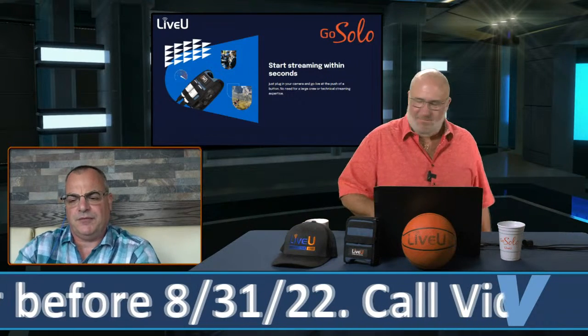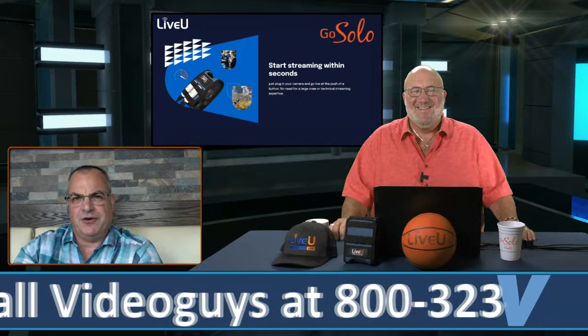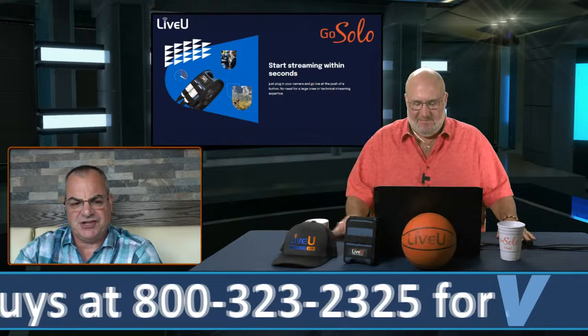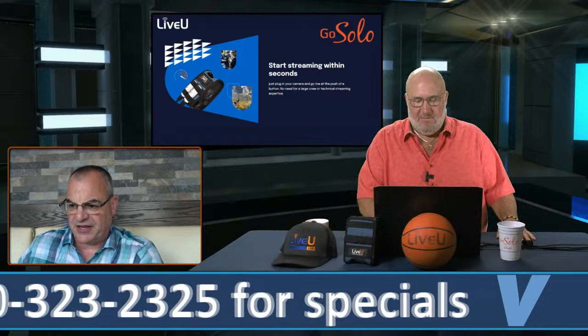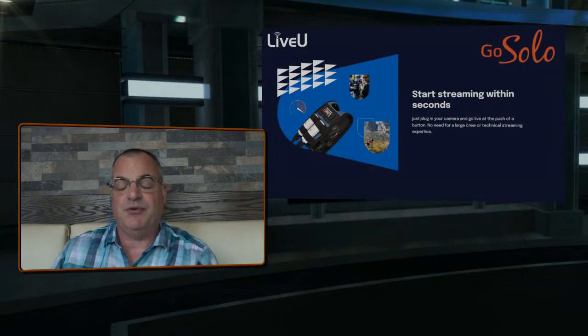Yeah, gotcha. I mean, when you first get it, you log into a website, you set it up, you put in your RTMP streams for whatever your destination is. But once you've gone through that initial setup, when you're in the field, it's as simple as pushing the start button, and within seconds, whatever HDMI or HDSDI input you're putting into the unit is now streaming live to Facebook, YouTube Live, wherever your destination is. So it's literally just push a button and go.